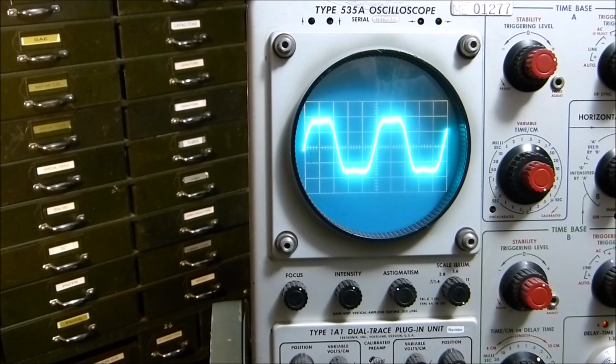As you turn it down, it starts turning it into a kind of a smooth square wave. We don't want it to have sharp edges on it, because that creates a lot of harmonics and our ears just don't like it. But that's actually what it does. That's what the clipper, that 6AL5 clipper, does to the audio signal. Now, of course, the distortion is increased to 23.9%. I can turn around and look at it, which is pretty bad,